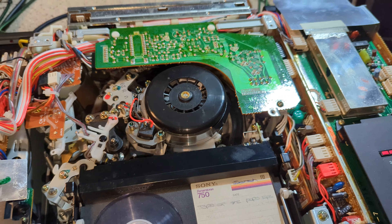They're just really poor capacitors. The later ones were better. From what I understand, these are the first capacitors from when Sony took over the Sanyo factory that made these capacitors, and they were terrible. That should be 0.33 - you can just see they're just well worth changing. That was a good call - you just need to change these caps.